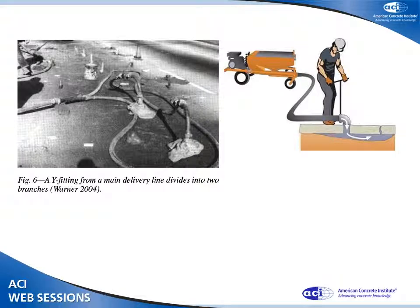Another little trick, don't try to pump everything at once. Wire off your hoses, have valves to control the flow so that I can lift a little bit over here, a little bit over there, a little bit over there, and keep balancing it out and running it around. If I try to lift from one place, I lift so far, then I have to disconnect, shut down, move the hose. You're ahead to do that with valves and T's in the piping.